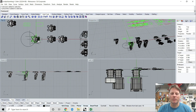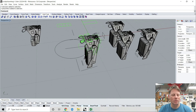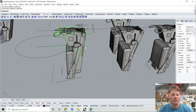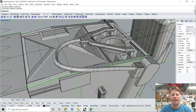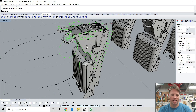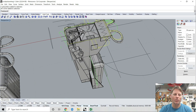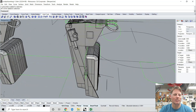When we zoom in here on the seat, you can see all my construction lines. Those are all the profiles that I created to make this three-dimensional part. I didn't go too crazy with the detail, but I did want to make sure I had some nice details like on the top of the seat - things that you would definitely see. I also knew I was going to print this on an SLA printer, a liquid resin printer that gets extremely fine detail. So I wanted to make sure I did model the stuff that the printer would capture. Taking these two-dimensional profiles and creating three-dimensional extrusions is really my approach.